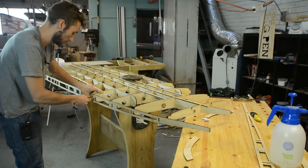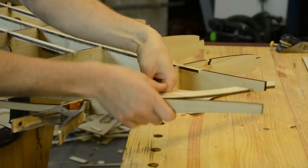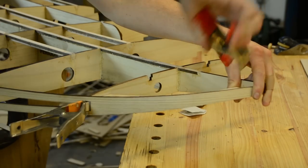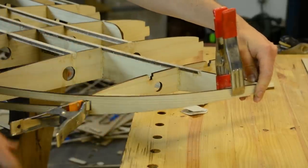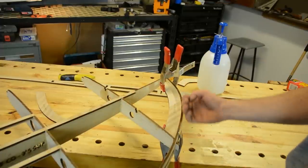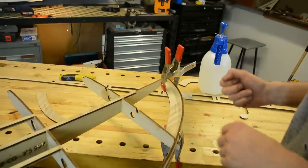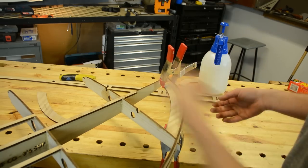That's nice and hot — just hold it in place with a couple of spring clamps, holding the piece marked 'rib' against the rib, and start forming the rail. You can see just how easily it bends now and with a spring clamp held in place it's going to hold its shape really nicely. From this demonstration you can see that by steaming the timber it's gone from something with a lot of resistance to something quite rubbery. If it doesn't feel like that when you're doing it, you haven't steamed it for long enough — stop, re-steam it, and try again. I'm going to let this side cool down while I start working on the other side.